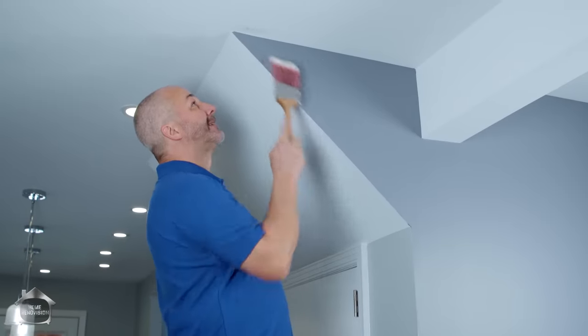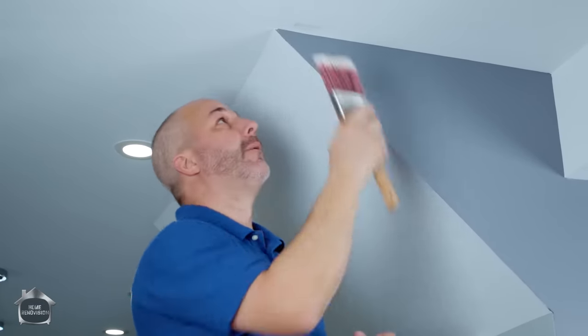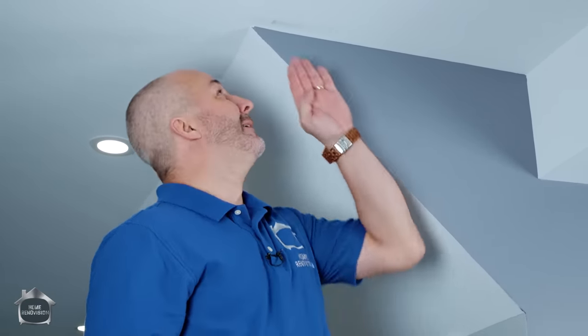When you hit the ceiling with the roller's edge and it leaves a dark color mark, it's only had one pass of a brush to cover it up — it's gonna take three or four passes. Until you can come back and you can't see it from standing right in front of it, you're not done, because at different times of the day with different lighting it'll show up. There's always gonna be that one person who had a painter that touched the ceiling and they'll be obsessed with looking at everyone's ceilings. So make sure you hit it three or four times and make sure it disappears.